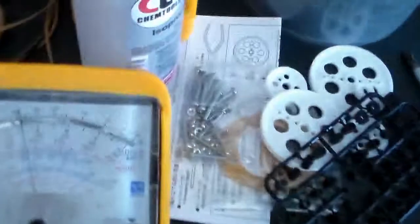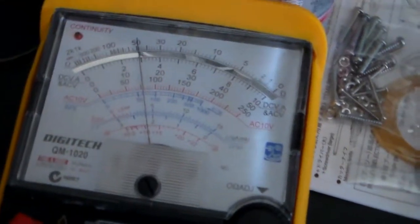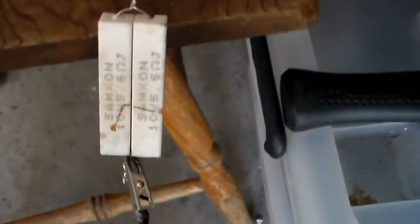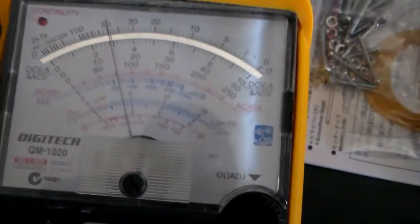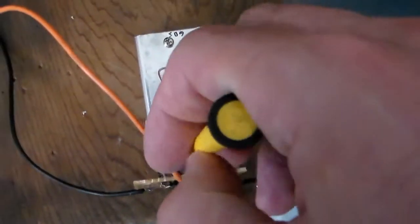But I can adjust the speed up to max speed. It'll draw something over 2 volts, and the current goes up to about 2.5 amps. It's probably a little bit much for the resistor to handle. Maybe just a bit over, or it probably can handle it, I'm not sure, but it's still quite acceptable in comparison to bloody 4 amps. The Nipkow disc is not going to be running at that speed, of course. That's way too fast for the NBTV standard. So let's just reduce it down.